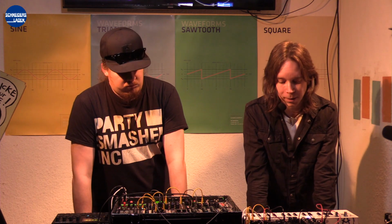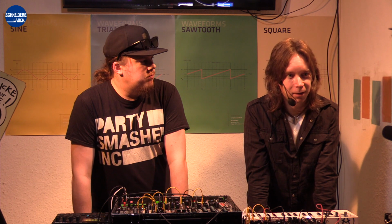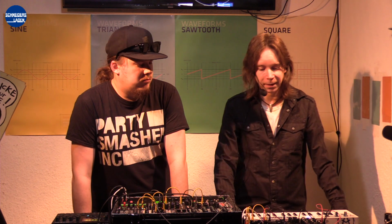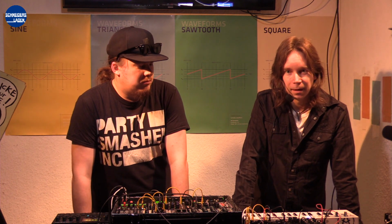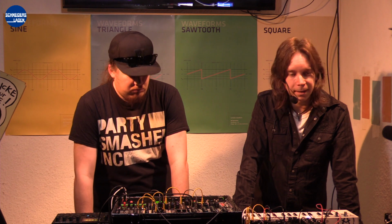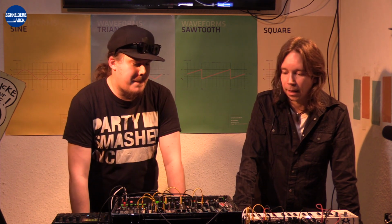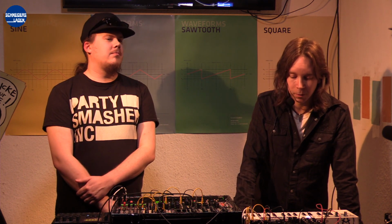This is one part of what I had in a polysynth voice I made as a hobby, that we picked out and built into a Eurorack module. The basic idea is that it's a DCO in the same sense as the Juno synths, but with a little bit of trickery so that we can actually fit 16 voices into this very small module.